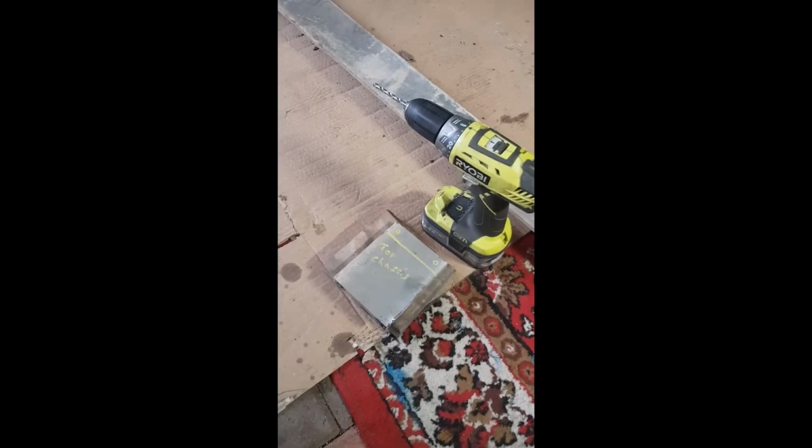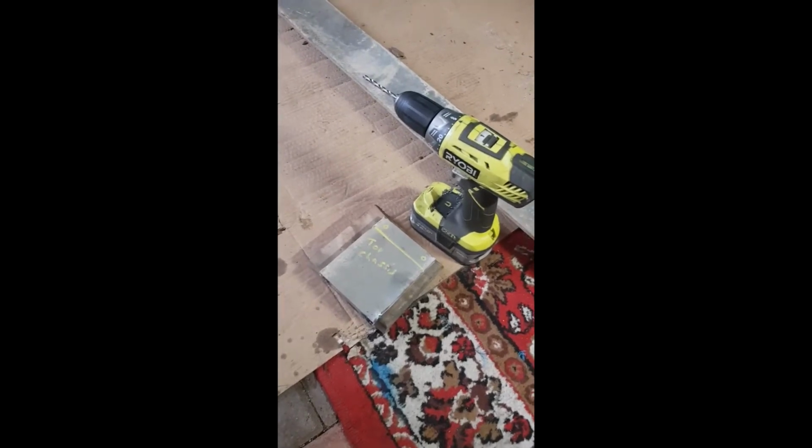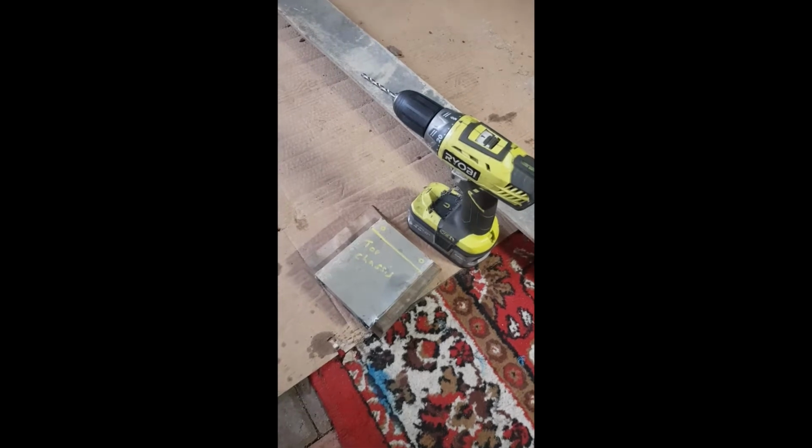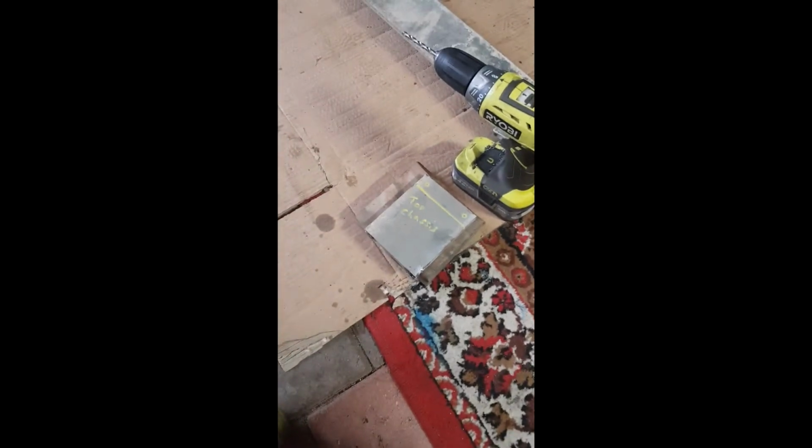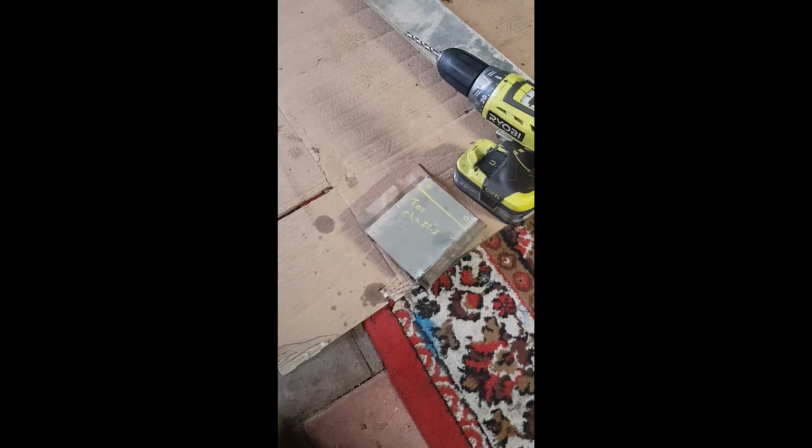I wanted to buy a nice bench drill, but I don't have enough money at the moment, so we'll use the hand drill. Go slow, plenty of lubrication. We'll start with our pilot holes, and then we'll move up to the holes we need to fit the bolts. I don't have any cutting lubricant on me handy, but a bit of graphite grease on the end, and just work nice and slowly, and she punches through.